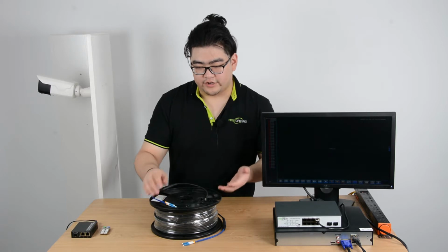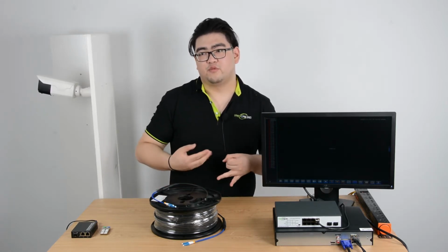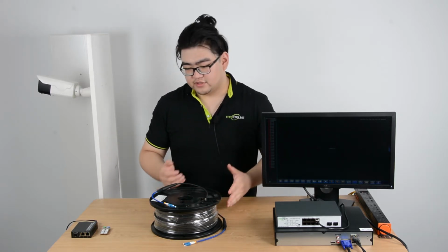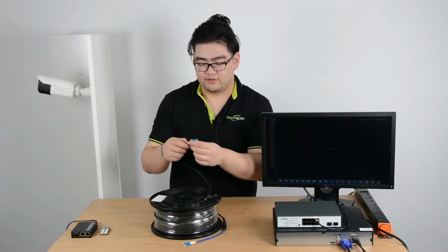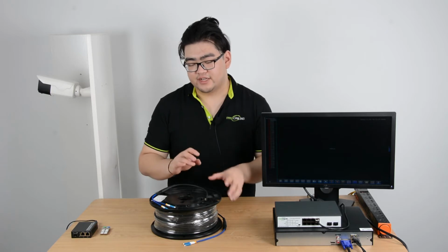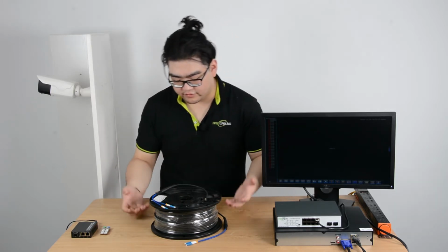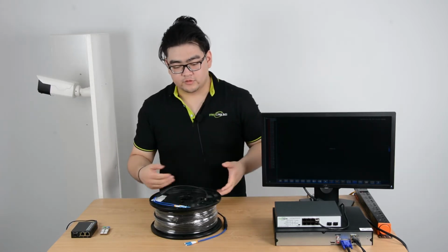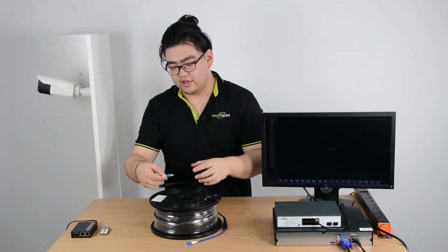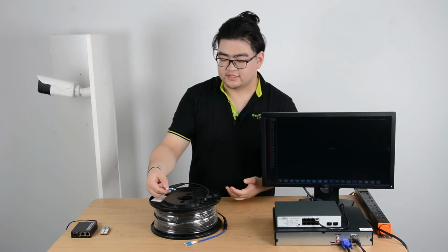So it requires precise machinery and preferably someone who has experience operating it. If you don't, when you connect the end with these connectors, plug in and test them, there might be a little crack somewhere and the signal will be lost. Then you'll have to do it all over again. So when I talked about just terminating them in the field, unlike our Ethernet cable, they require a lot of precise work.